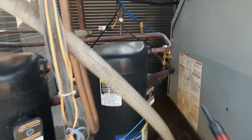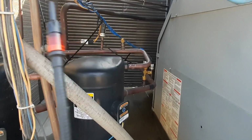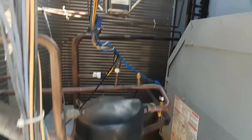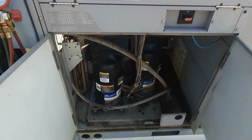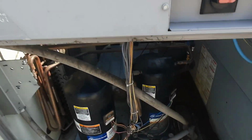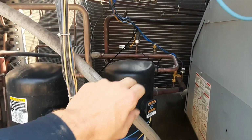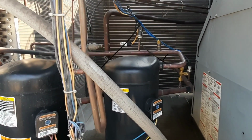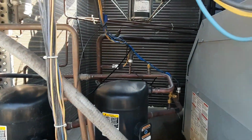So we're gonna get at least new caps, maybe a swivel tee on that guy to stop it from leaking. Because it wasn't tripping low pressure, so it's got most of its refrigerant. It's only lost a little bit, I would assume. We put, I think it was like 3 pounds in the other stage. I think they hold 9 or 10 or something. So we're not going to recover just to change that valve core, and I don't have a tool. If we can't stop the leak, which we probably can just by putting a gauge on it, we'll recheck it and just let that seal reseat. And then if we need to, we'll put a swivel tee. If nothing else, we'll throw new caps on it.